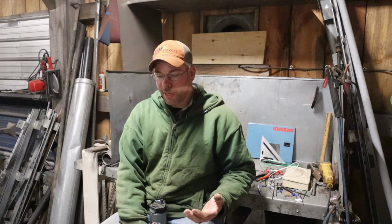Three-phase motors are less than half the cost of single-phase motors. And it's crazy, a lot of that is you only find them in industrial applications. If you're going to buy used motors, a lot of times you could get a three-phase motor for 10 to 20 bucks per horsepower. That's pretty good. It's amazing what you can get used even. How many of your local high schools have you seen that have auctioned off all their shop tools that ended up being three-phase? A lot of times you can't get them because you don't have three-phase power. Well, this is your answer.